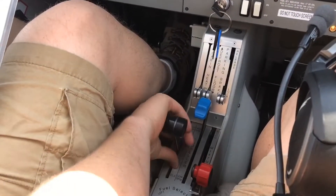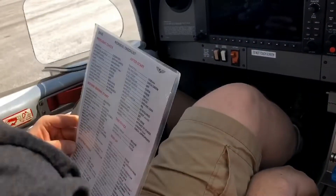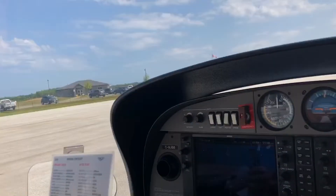And make sure we're at mag cutoff. Throttle three centimeters. Throttle check. Prop area — clear left aft, clear right aft, clear above.